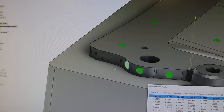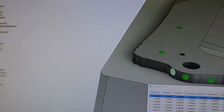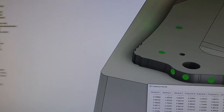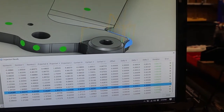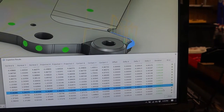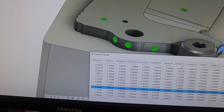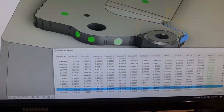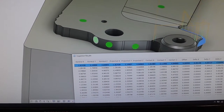The worst one is that shoulder at two thou. But it looks like we cut it and there's no more bad deviations on the back edge. In fact that one gives us a deviation of only three tenths — very interesting, that's a good sign. This one is another three to four tenths. But this one is two thou.